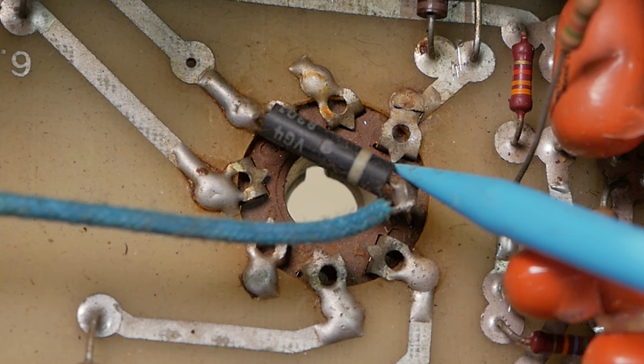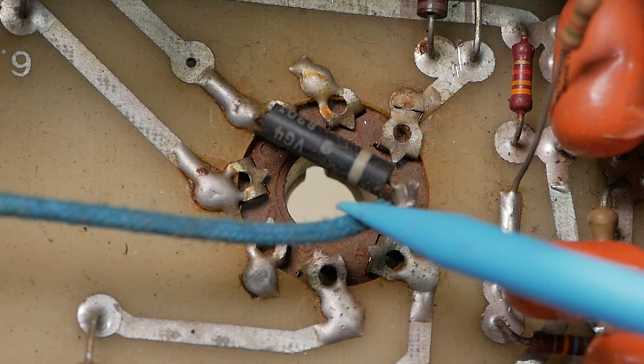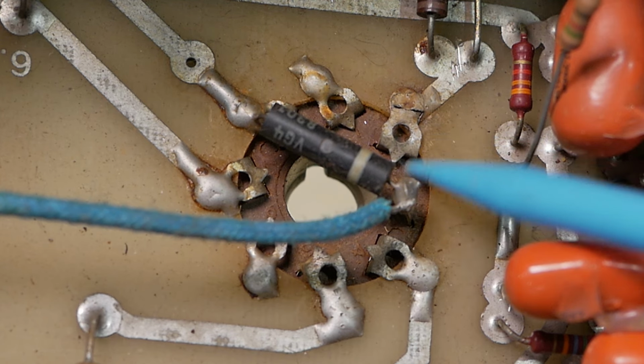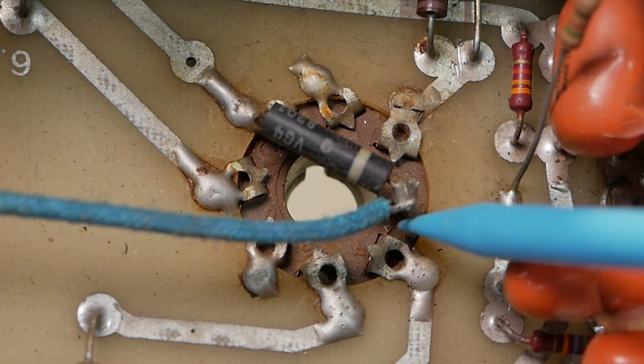So when you've got an open circuit, it tries to divide by zero, essentially, and tries to maintain that same current by making the voltage go up. With an open circuit, effectively infinite ohms, it tries to make infinite volts to maintain that same current. Obviously it can't do that, but in the process it gets to several thousand volts, enough to arc over nearby connections, like you've probably seen arcing on the circuit board, usually between the plate and the heater, because the heater's pretty close to ground reference. So that's the shortest path. The nearest path is the plate, the screen grid, and that's often pretty close to the plate voltage.